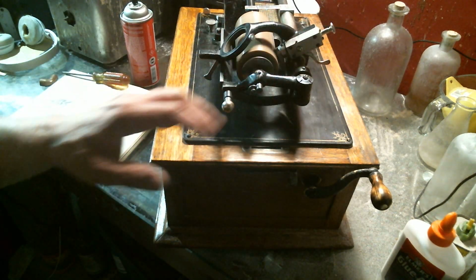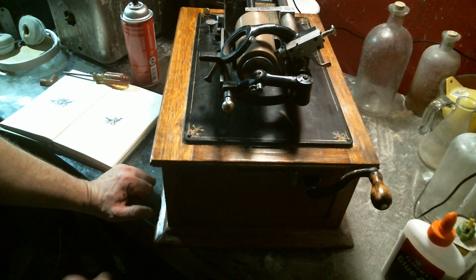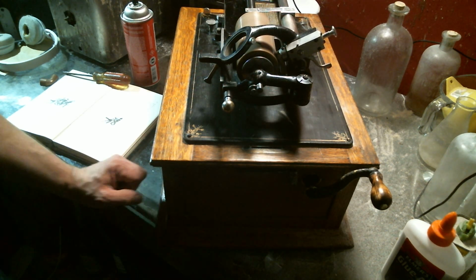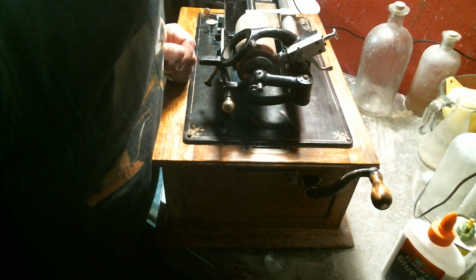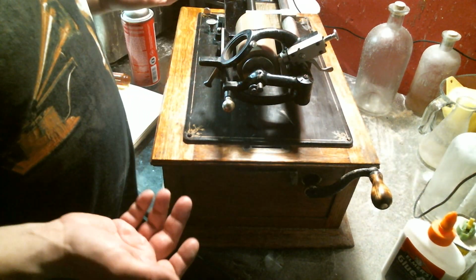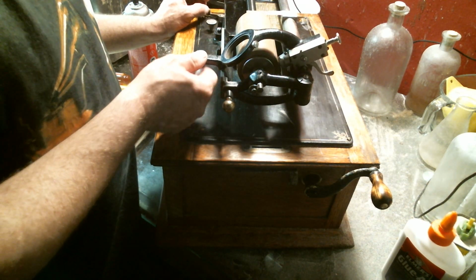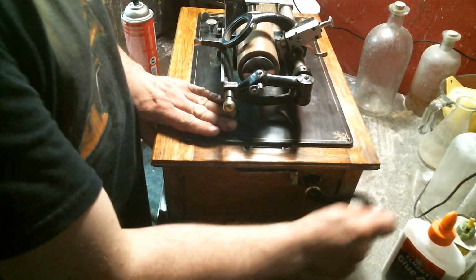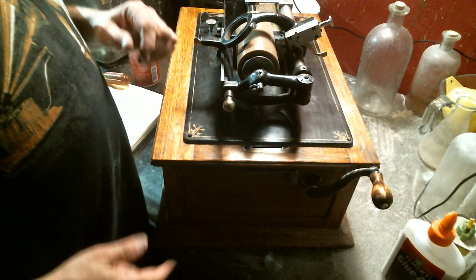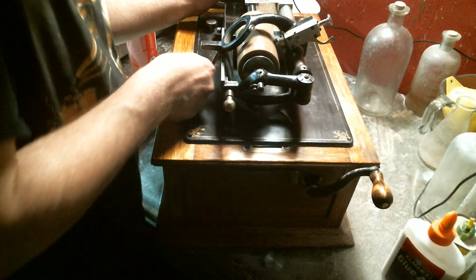The main thing is never to set the knife in the up position, because if you try to cut it, of course, it'll be too deep, and the machine will just stop, and then you'll have a big gouge in your blank, which you do not want. So, yes, this also trues your blank to your phonograph, so that it is more true to the machine that you're recording on. When you shave on the machine that you record on, the recorder will actually follow it more nicely. So we wind it up again, and again put that lift lever down.